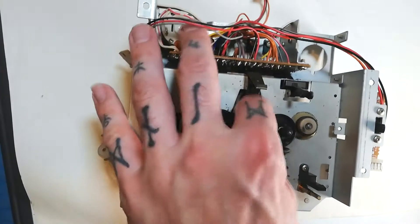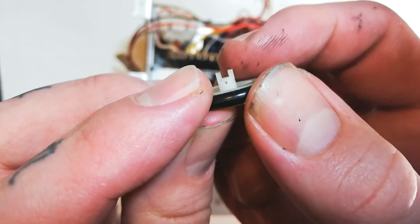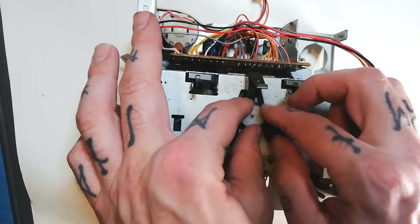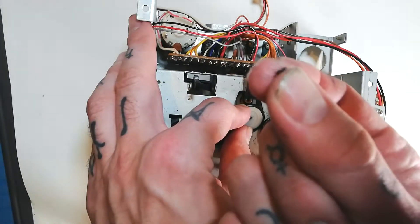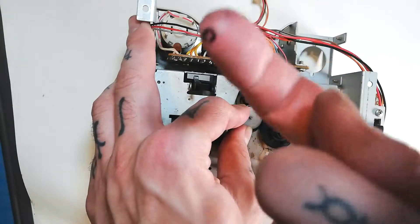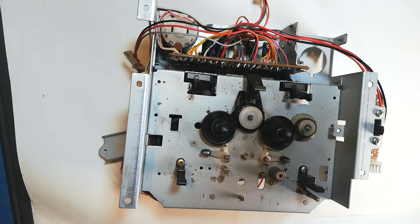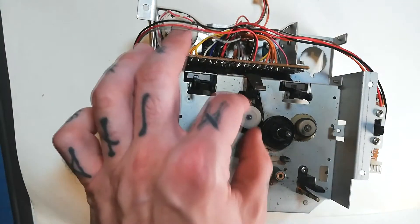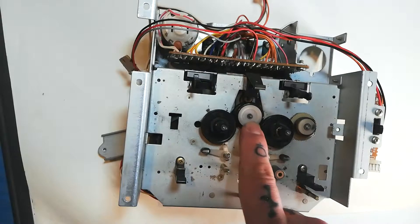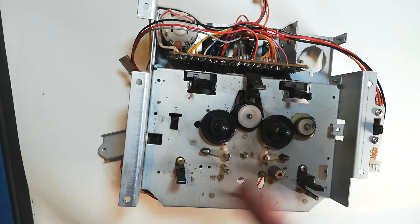The one with ridges goes at the bottom. Then we get our spring, put that in the center. See how there's a little tooth or rampart there — that's going to fit into the corresponding tooth or rampart on the bottom wheel. There's a little bit of metal sticking out. We then get our little clip. What I do is get my finger a little bit damp — I stuck my finger in my mouth and now the clip is kind of stuck to my fingertip, so I can just push it over the top of that metal pin and it'll stay in place. Give it a squeeze, close the tweezers, and that's going to stay there. If you imagine that you've either filed down the rubber parts or these are the correct size, then that's you — you've installed your idler tires and they're ready to go.